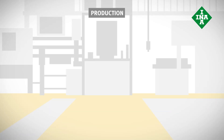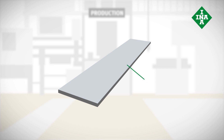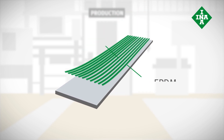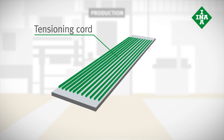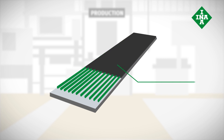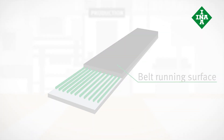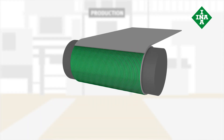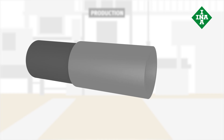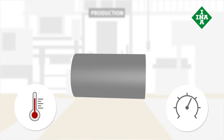The process of manufacturing a multi-ribbed belt is highly complex. The back of the belt is made from an especially abrasive-resistant rubber compound known as EPDM. Multiple tensioning cords are then placed on top. These tensioning cords are generally made of polyester or aramid fibers. The material that provides the running surface of the belt is then added. The layers are applied one after the other onto a support roller, then subjected to pressure and heat before being vulcanized in a steel mold.